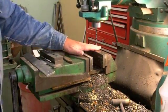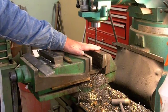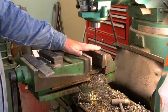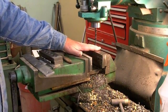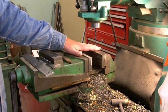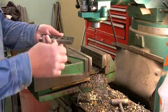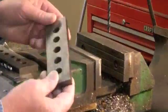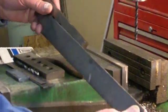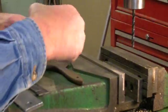What we're going to do here — this is a milling machine and it's a milling machine vise. If you don't have one of these and you use a drill press, which I've used over several years before I was able to afford one of these, you need to set your vise up so that you can do multiple holes in multiple pieces of metal and have them match and line up. You can use parallels or just pieces of steel to get the accuracy. Basically, all you want to try to do is get these fairly parallel, so we'll put these in here just to level it out.